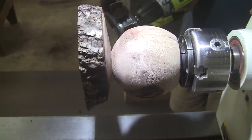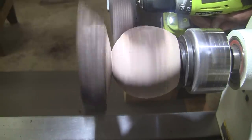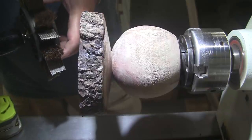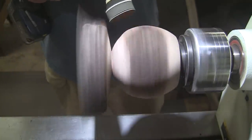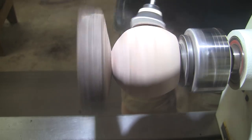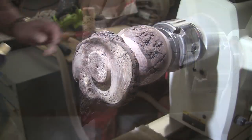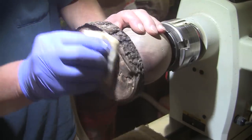Now I'm on the other side, spinning forward at 350. That plastic Sandflex is so light — I don't think it weighs half a pound. I'm sure the metal ones weigh two, two and a half pounds. Now with the lathe spinning in reverse at 350 still. Maybe some hand sanding in there too, but I'm going to get it sanded and it's going to be gorgeous. Then we're going to put some sanding sealer on here.